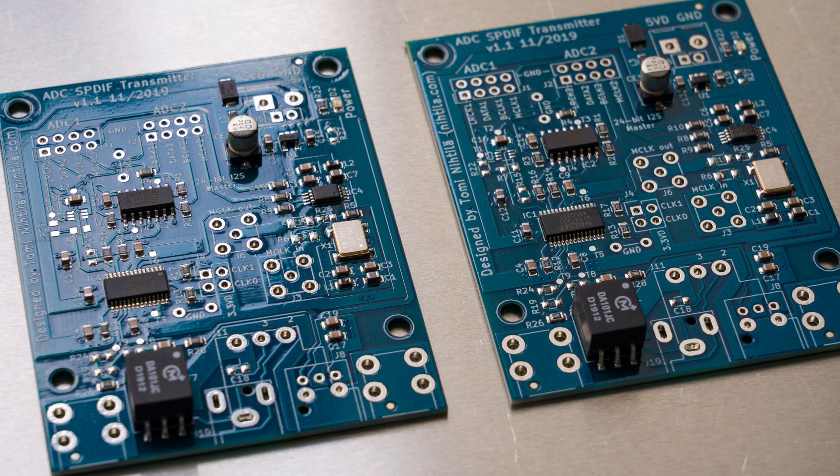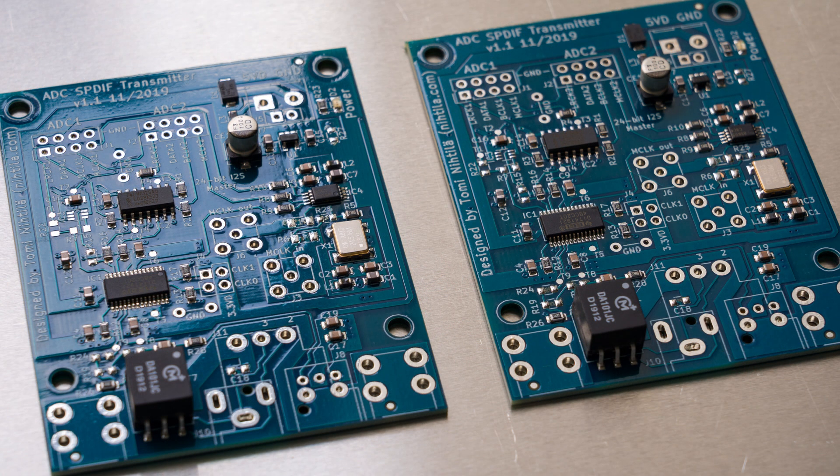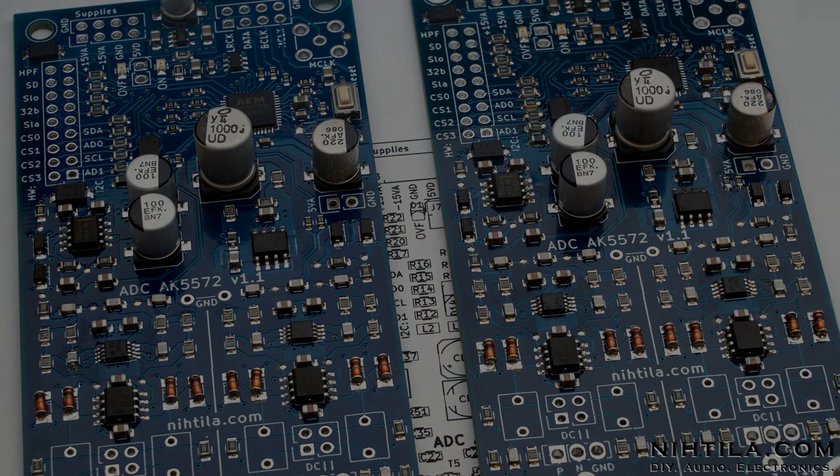Here is the result after reflowing — no complaints whatsoever. Everything looks neat, the components are nicely in place, no shorts, and both boards worked fine. By the way, this board is an I2S to S/PDIF converter and it's available to purchase — I'll add a link in the description. This was the second real board I soldered — a very high performance ADC, also available. It's a more complicated board as it has a QFN package and some SO packages with a thermal pad beneath. I did have a little bit of issues with this one, but overall it's fine — I just need to improve my solder paste applying. That's all for now, catch you next time.